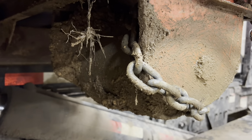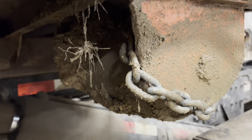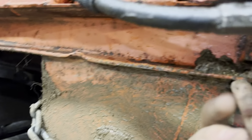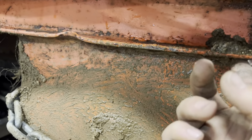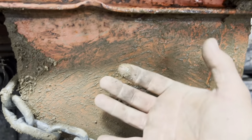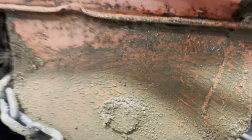could cut these rollers off and raise them up a little bit. I think they're welded right. Yeah, they are. They're welded right to this channel here. So if I torch this off, we have different wheels. I could raise them up in there and weld it.